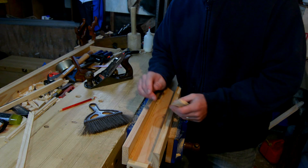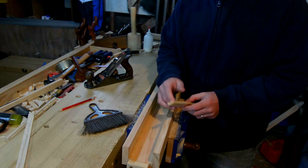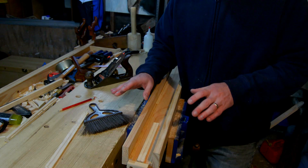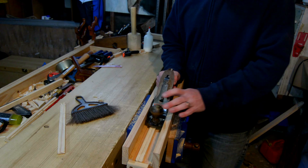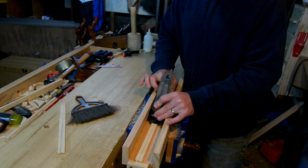Make sure, if you make this jig, that the bottom is flat and even. Another thing I was running into is that the piece will move around left and right, so you may want to figure out some kind of wedging system to hold it more in place. I did do something like that for a while. But the plane goes in here and we start planing.